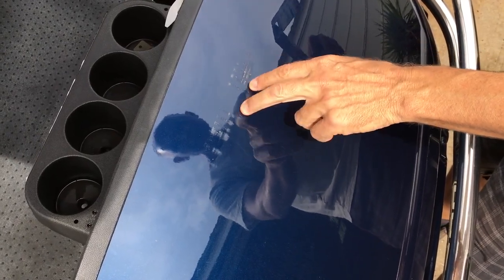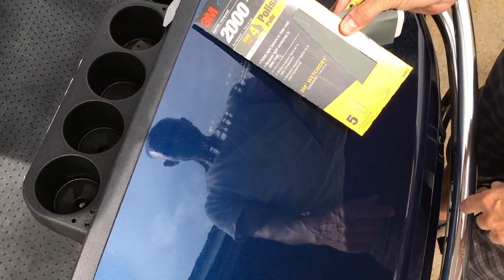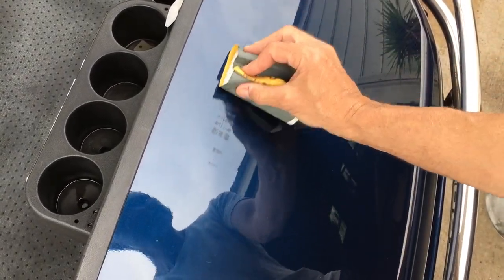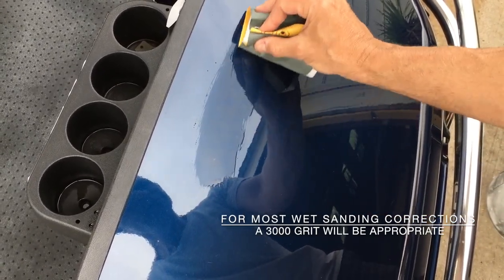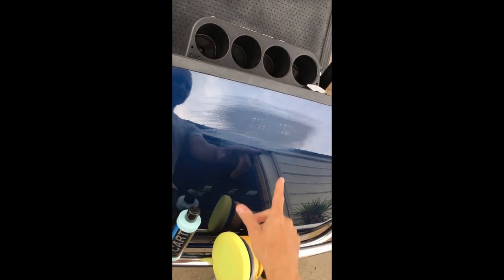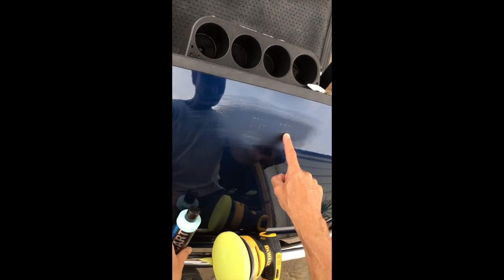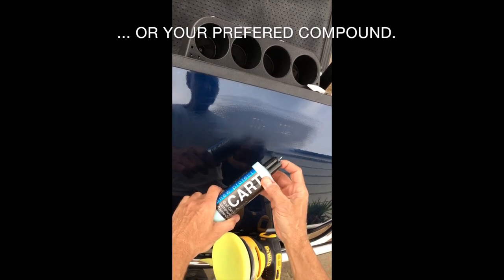We've got a little damage from our acrylic windscreen, and this is going to be a little beyond the abilities of our cart compound polish sealer — our one-step product. So a simple step of wet sanding and then we will buff that out. I've got my 2,000 grit wet sandpaper and I'm using the foam cleaning block as my backing, which is holding the water for me. This will level that imperfection down to a consistent level we can work with. The damage from the windscreen is a little deep — it's going to be beyond complete correction, but we're definitely going to make some improvements.